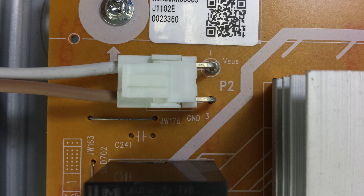When using your meter to test the pins on the connections, the only pin that should show up as a short to ground is the pin that is labeled ground. Not every connection will have a ground pin, but if you see that, it is normal for that pin to show up as a short to ground.